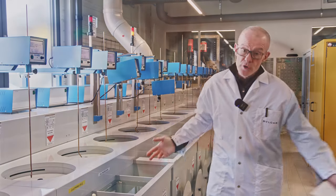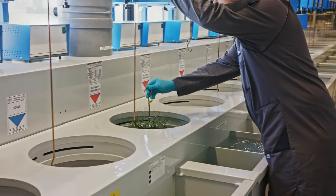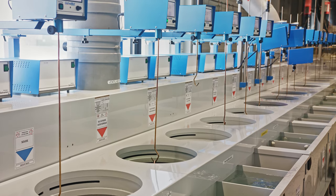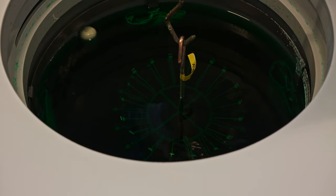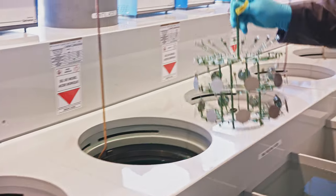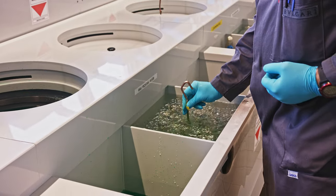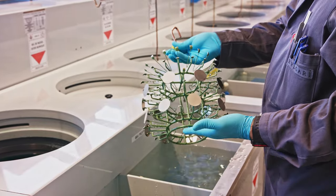After the noisy machining operations it's calmer here, and what you see is a huge laboratory. This is galvanic treatment — different methods to create colors on the dials: varnishing, lacquering, all happens here. You want to give dials colors and specific surfaces, and everything is done through these different chemical baths where the surface is treated, taken out, washed, put into another liquid, and then the color builds up on the dial as desired. It's a bit like a miracle, but without galvanic treatment, no colors would be on a watch dial.